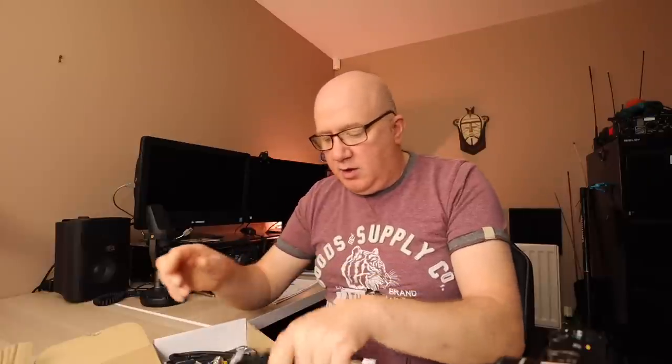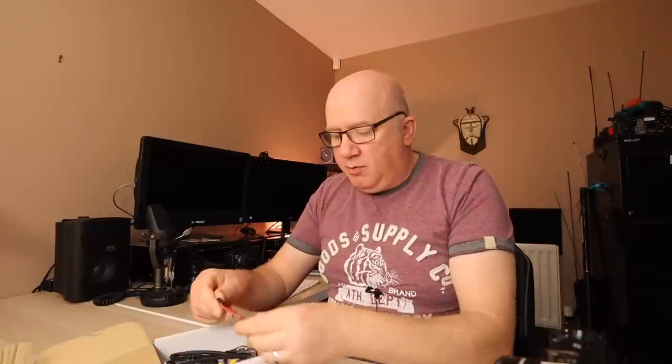You know, we get a lot here to enable us to actually suspend the wires on the actual pole. One really important piece of kit with the DX Commander is the connector from the radiating plate to the SO239, because I know from my own experience this gets a lot of battering, it gets a lot of tension, especially when the radiating plate spins round on the pole. This gets a lot of twisting going on. So with my DX Commander 7 meter version, it's weathered quite a lot of battering. So again, this one is really well made.